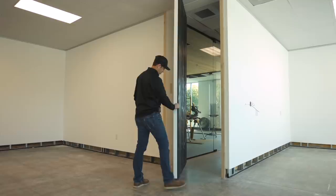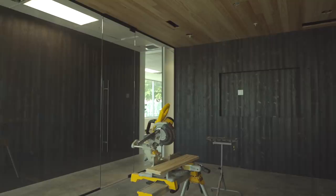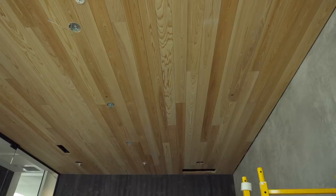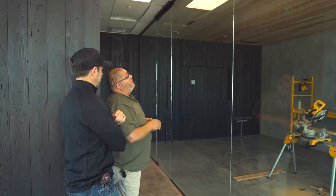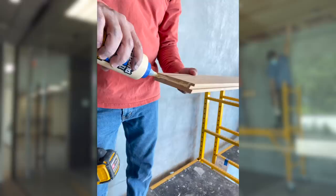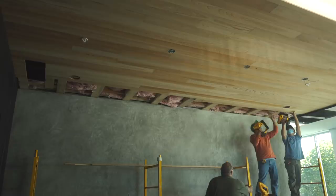That really shows off your craftsmanship — that recessed box for the TV with those really difficult miters where the boards run continuous. When we started the ceiling, I thought about lining up the lines, but the ceiling boards are a little bit wider and a different color, so we didn't line them up — otherwise we could spend a month trying to make that work. On the walls we've got full boards, but on the ceiling we had to join some. We did 30-degree scarf joints — that's where you cut at a 30-degree angle so when it overlaps you get a little meat in there — and at every joint we use Titebond to seal it and give room to attach them both together.